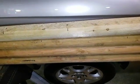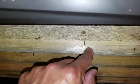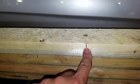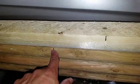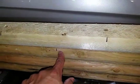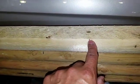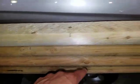So another thing, you see how I have this screw here and I have a notch here? Make your marks on the outside so that you can stagger them. Because see, right on this row, that's where this is. So I knew exactly where it was, so that I wouldn't drill on top of a screw that was on the bottom level there.